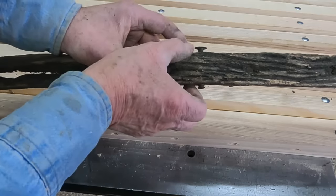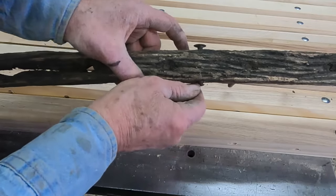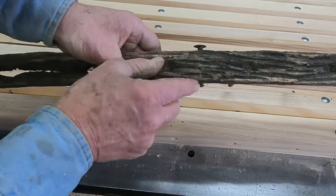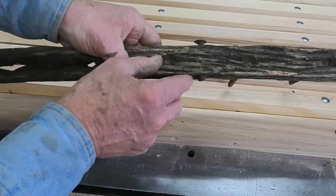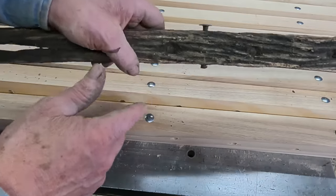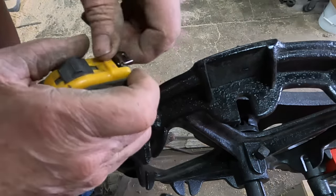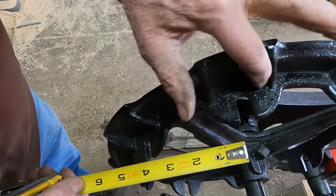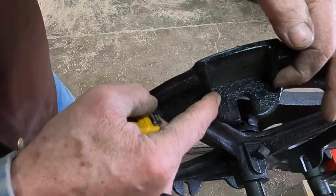And that's how I determine the width of this wood, from the flange of this riveted end to the flange of this head. And that is 2 inches or strong. I made mine actually 2 1/8 to fit the casting on the beater itself. Since the distance between these two casting faces here was 2 1/8, that's what I made my wood. So these end up adding support against that splitting also.